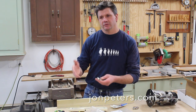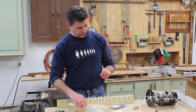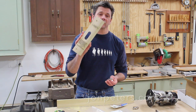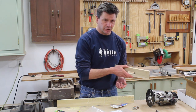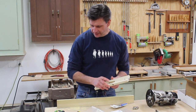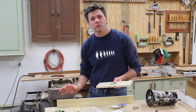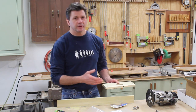In the case of the TV lift cabinet, it will be mortised into the lid and the top. I ordered a few of the hinges along with the jig for my plunge router, and I've spent maybe the past 15 minutes dialing everything in. I've already mortised for one hinge, so let's go ahead and do another one and I'll show you how it works.